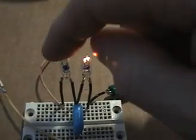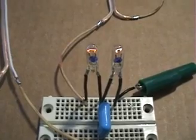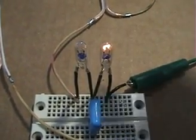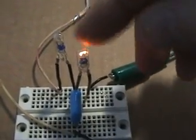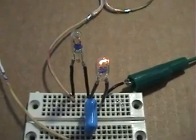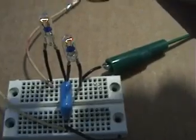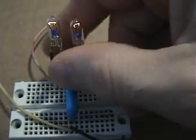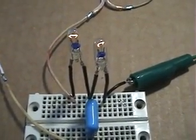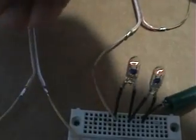...notice that this bulb went up. What we want is to transfer all the energy to the coil on the resonating side — we want this bulb extinguished and the other bulb lit. Right now we have the opposite. Tuning shows it's wasting energy and not giving activity on this side. There's no benefit with this particular capacitor, so I'll take that out.